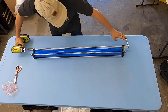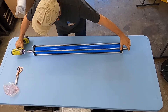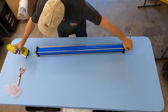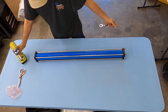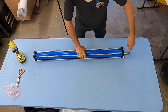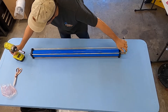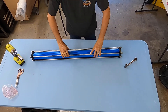I'm going to put this at the lowest setting, number one, and start by snugging these two. Then I'm going to go diagonal to the next one, then diagonal again, until it stops. Now I'm going to feel the drag — I want to feel quite a bit of drag here; I don't want it to spin freely. So some of these I'll go a little more. You just want these under a little bit of tension.